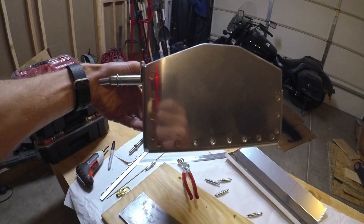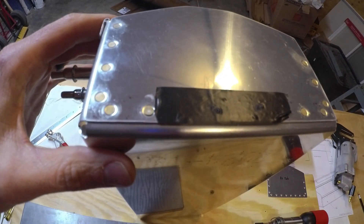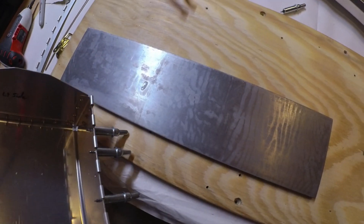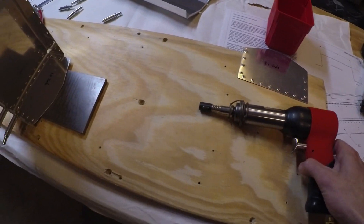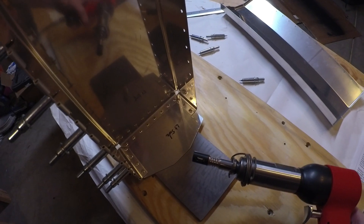So now I get to show you how to back rivet using the rivet gun. I went ahead and put all four rivets in there and put a strip of tape over that — you can see those four sticking out. Those rivets have not been set yet; you can see it compared to the one next to it. So what we're going to do — we've got this backing plate — I'm going to turn it up on its end and use this rivet gun with the back riveting attachment to smash those guys down.